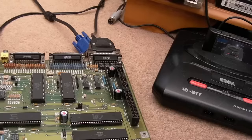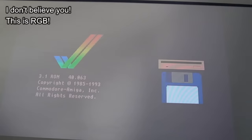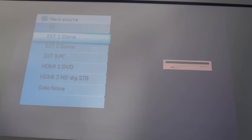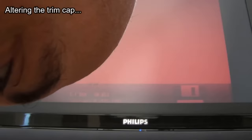Let's plug that in — ESD wrist strap on, get it into position, VGA in. Ideally with something like this you want color problems or speckles, because then you're in the realm of it being a RAM fault. Oh — it's working and it's line doubling! If you don't believe me let me find the remote — actually that looks absolutely amazing on RGB. That is not what I expected. But we've still got a white screen on the VGA output.